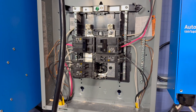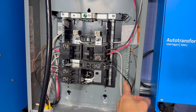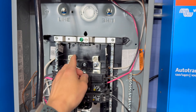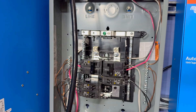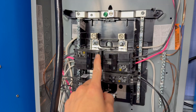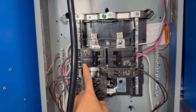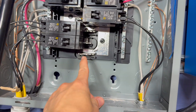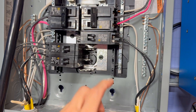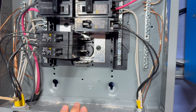If you're not too familiar with a load center: the entire metal casing is ground, and the ground bars are also ground. In one location, the green screw bonds the ground to the neutral bar. We have this double-pole breaker feeding two legs — black feeds one, red feeds the other. A double-pole breaker uses two slots and connects to both legs, which is how the 240V really works.